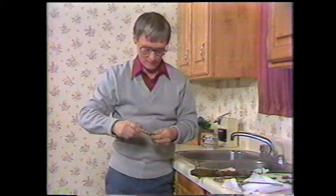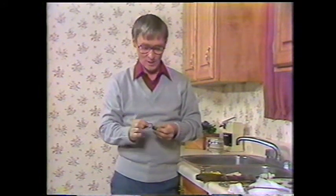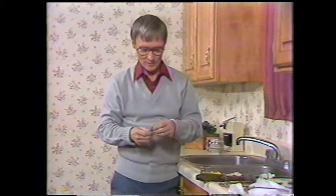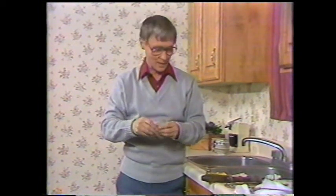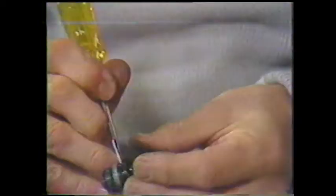Then use the screwdriver. Now, replacing the O-ring. There are several different sizes, and obviously this is not going to be the right size. It's a little too large to fit on there. But I think that's the old one. There, that one should fit. Looks to be the right size. If you have trouble getting the O-ring down over this part of the cartridge, the shaft, you may want to coat it with a little bit of liquid dishwashing detergent, and be sure you get it into the right place. Scratch-all can be used like a shoehorn.